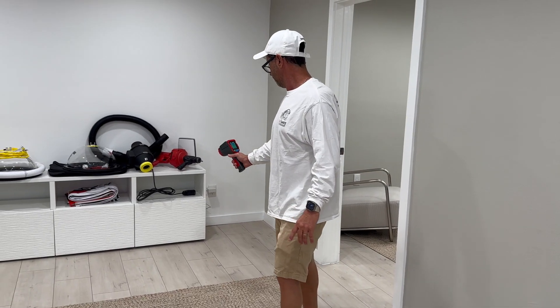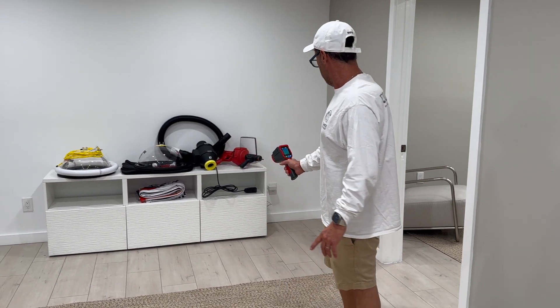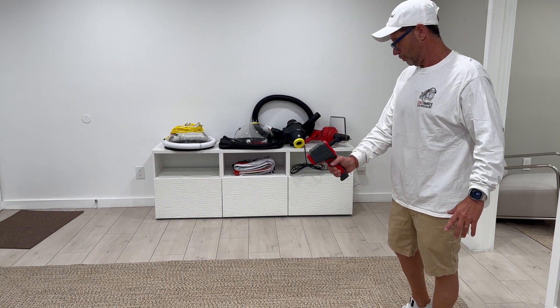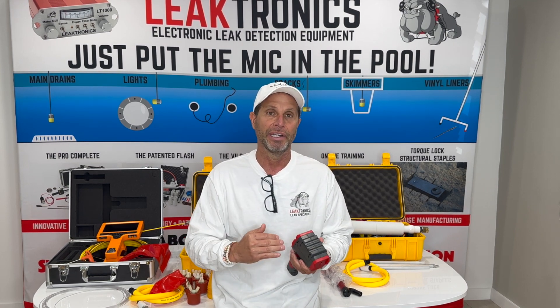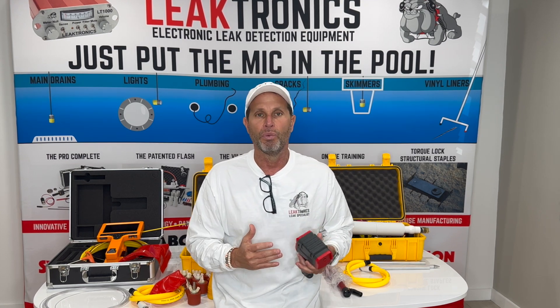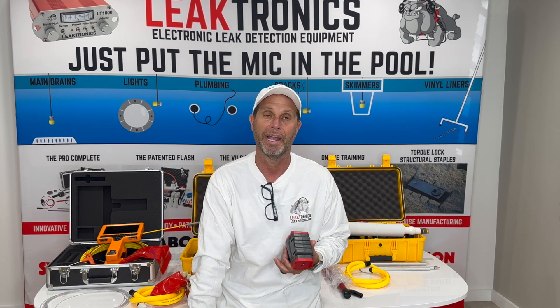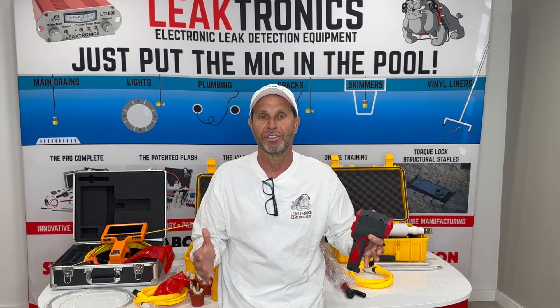By entering a building, if you know your leak is on the hot water side, literally hold this unit down and scan it. It's going to show a lot of different reds that will settle down, and then anything that's really hot is going to be glowing — that would be the area of the leak. Mark the location that you saw. Sometimes you can just hold your hand to it and feel it, but this does it on a much faster and grander scale.